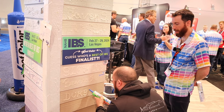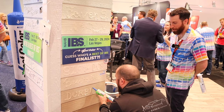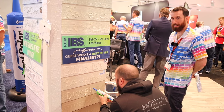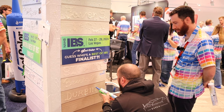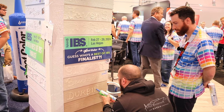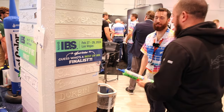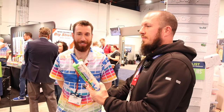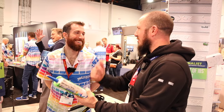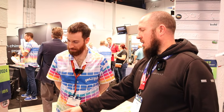These guns are actually from Albion. We don't make any caulking guns ourselves, but we use a whole bunch of them. I like a good 10 to 1, 12 to 1 ratio. The 26 to 1s are tough because you'll usually blow a tube in no time. I don't like how slow they push out product either. If it's 20 degrees outside I can understand needing a 26 to 1, but otherwise this is what I'm using. Really cool — really good color match already.